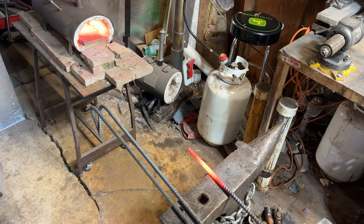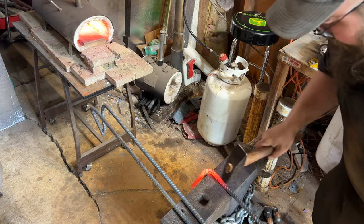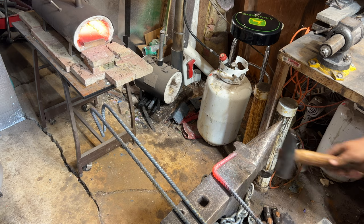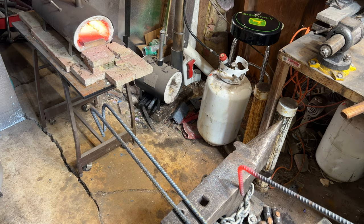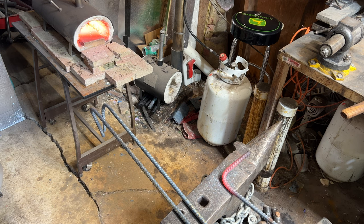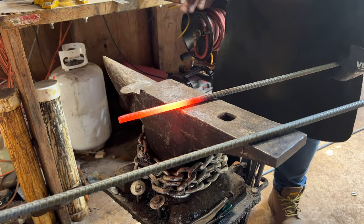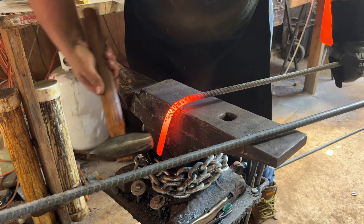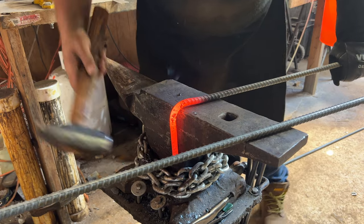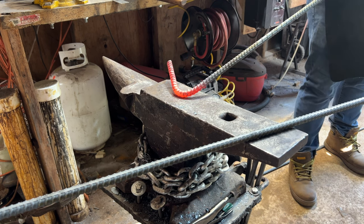We're finally to the fun part — forging out these bends. The first thing you're going to want to do is knock over the first bend to 90 degrees. The most simple way to do that is to hit it on the far end so that you're hitting on colder steel and not hitting directly on the bend. If you hit directly on the bend, you're going to get a weird wave in your piece of steel. Once you've done that, push it on the side of the anvil to give it that nice just-past-90-degree bend. I'm hitting on the end of the piece so I'm not hitting directly on the bend — this makes for a straighter piece of steel overall because you're introducing less waves and wobbles. Then, just like before, give it a push on the side of the anvil for that just-past-90-degree bend.